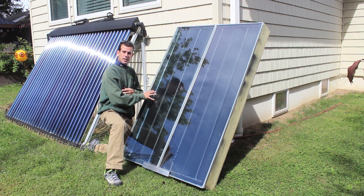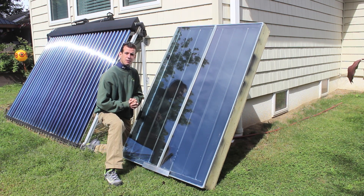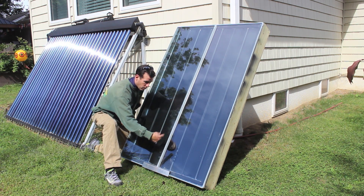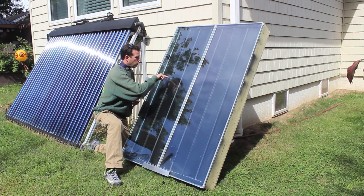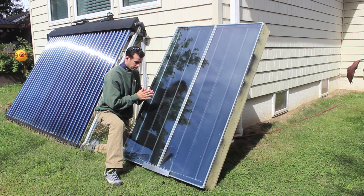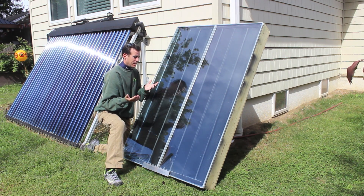We get this heat, we want to hold on to it, but then we want to distribute it and get good heat transfer. The soffit material is really neat — we basically pressurize with the fan blowing air onto the front of the glass on the inside, and it's forced to go through the little holes all over the soffit material, rubbing against it. That's where we get our heat transfer. We can have a collector that collects all this heat, but if we can't put it into the house or whatever structure you're trying to heat, then it defeats the whole purpose.